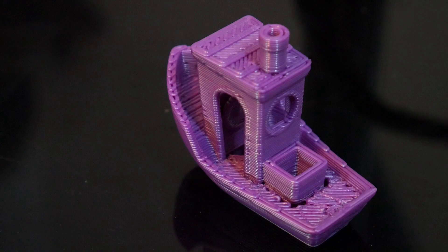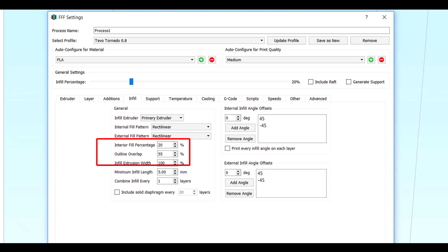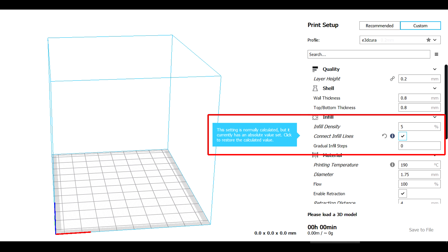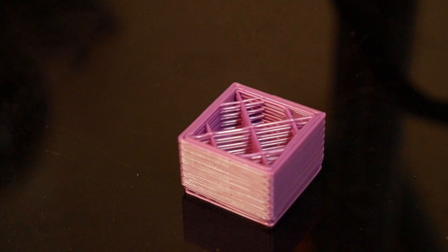In terms of slicer settings I found there were a few little quirks that needed ironing out. The main one is that the infill doesn't quite meet the perimeters and falls away. This problem has the potential to ruin the structural integrity of your prints. In Simplify 3D there's a setting where you change how much the infill overlaps with the perimeter — I upped that to 55% from about 20%. In Cura the same thing is called 'connect infill lines,' and in Slicer it's called 'overlap infill/perimeters overlap.' Something around 50 to 60% seems to be pretty good.